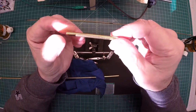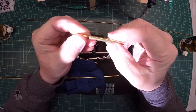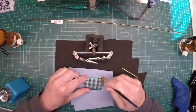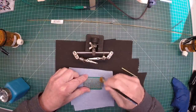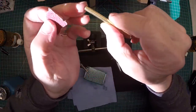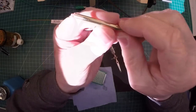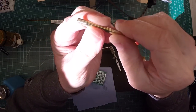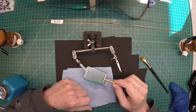And there we have it — the 3/16 outer diameter cut to 2.5 inches in length. I'll take some alcohol and just clean the circuit board off where I'll be soldering. I'm going to take some sandpaper and rough up the brass itself to make sure that I get a nice solder connection. You can see it's roughed up nicely there on that edge, and only a small part of it would be mounted to the circuit board.